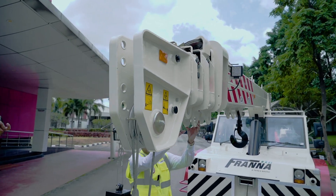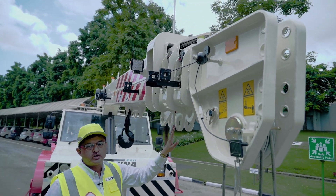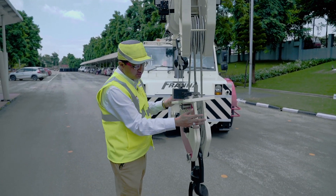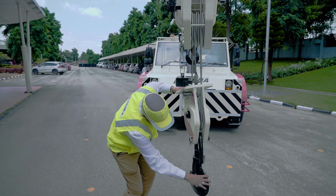The five lifting options are for 17 ton, 12.4 ton, and 8.2 ton capacities. There are also two moving hooks, which give an added advantage over the old slotted boom. It comes with a three-fall system, and with this three-fall hook block we can lift a load of 10.5 ton.